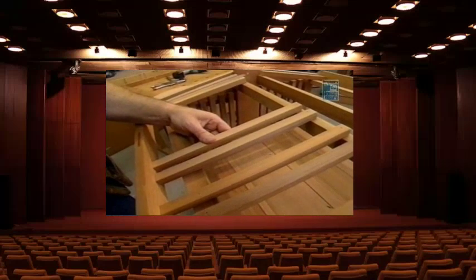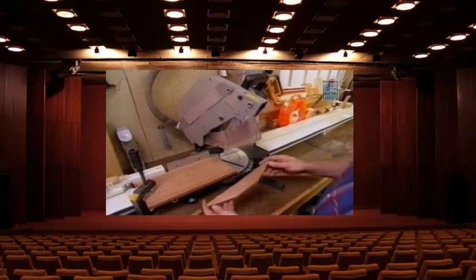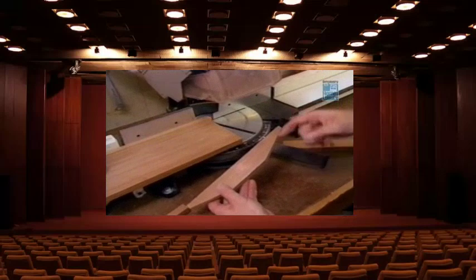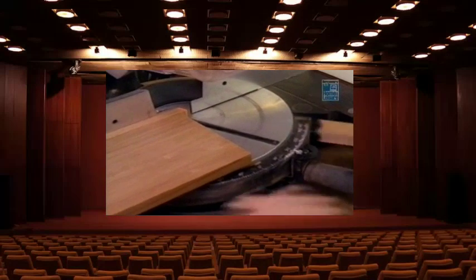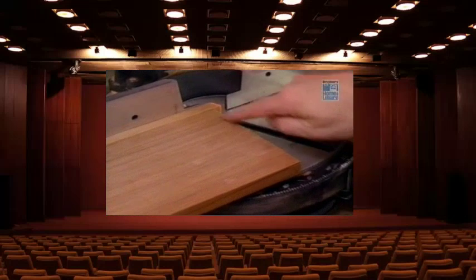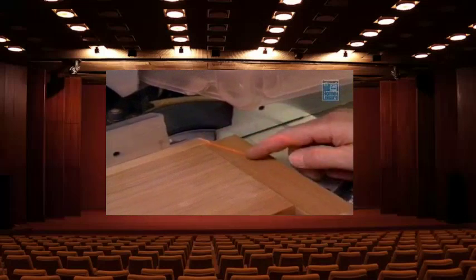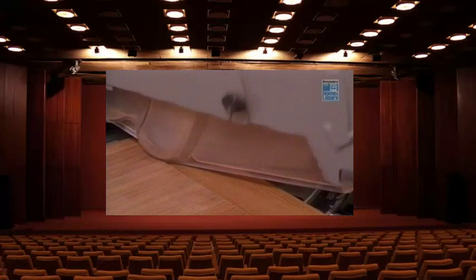Here are the remaining slats. Now I want to make the cleats that hold the upper shelf — they have an angle cut on the bottom. I could use the trim saw, but it's short enough that I can use my miter box if I make a jig. The jig holds the piece square to the fence and a little stop holds the piece from sliding through after it's cut.